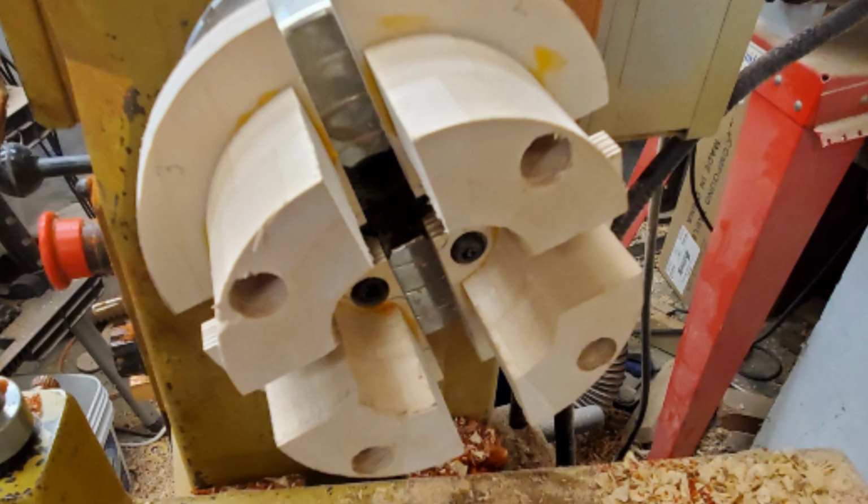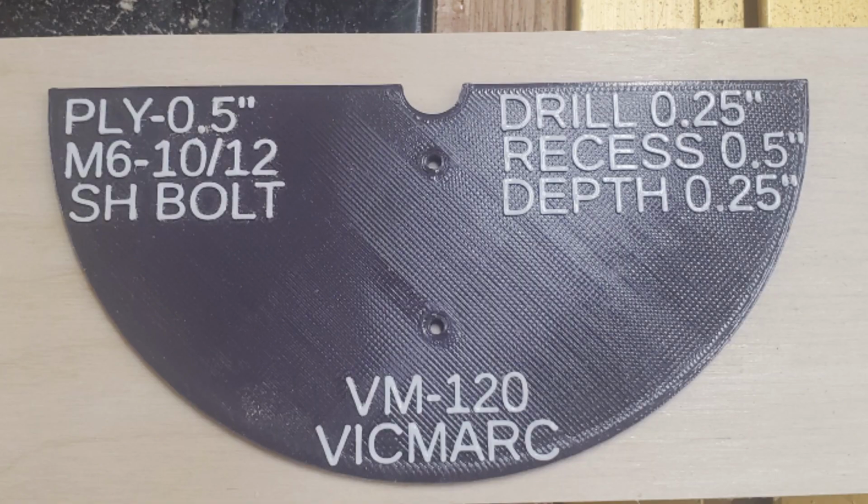I also made a set of jaws with segmented techniques. However, I'm not sure it was worth the extra effort. Now for the parallel jaw style. This looks as if it would replace two jaws at once. However, if it did, the chuck could not expand and contract. Instead, each side is expanded 45 degrees. One replaces two jaws, but bolts to the base of only one.